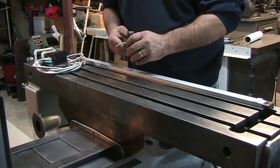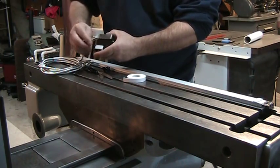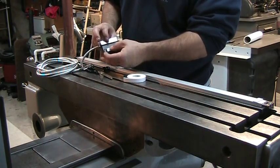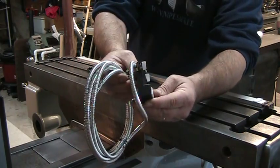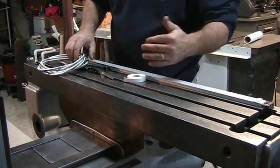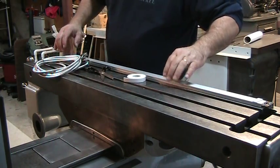We're going to put some tape on the reader head as well. This has a simple installation mount that comes with the unit. The reader head bolts on at the top and there's what looks like a cast aluminum mounting bracket that has a step in it — just about the width of the slide itself. The reader head should fit right up snug against the axis, given the shim they provide, which is about 20 thousandths thick, as a standoff between the reader head and the magnetic scale.